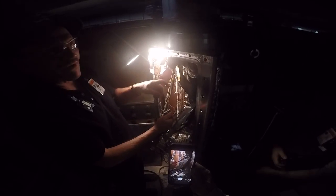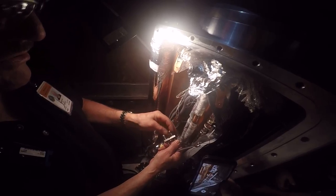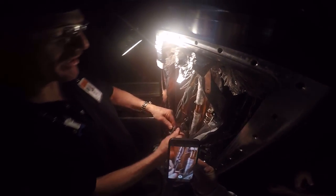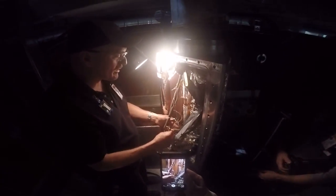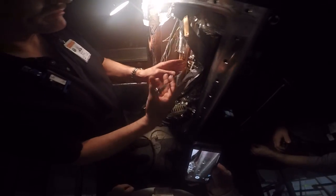This was all metric copper, and everything we did was standard, imperial. So I had to make conversions, and I want to cut it on the standard stuff. So you just use a standard coupling. I could not get sweat fittings in metric sizes at all.